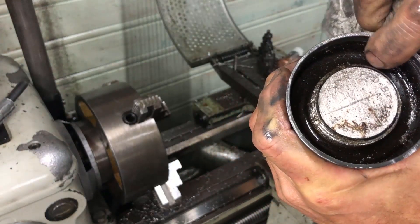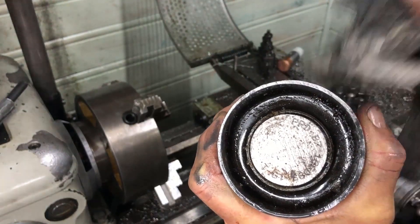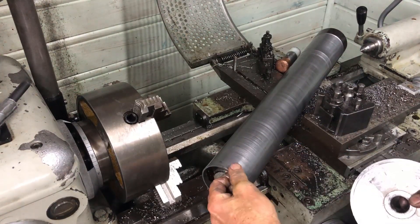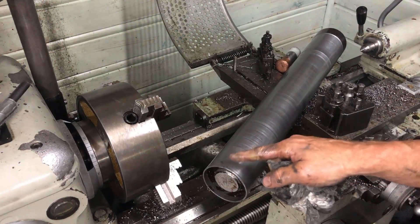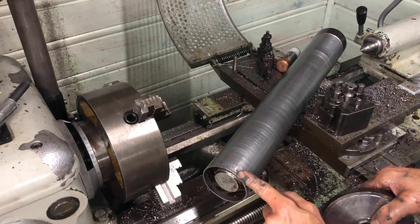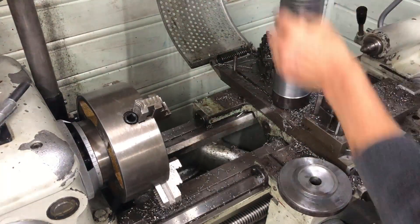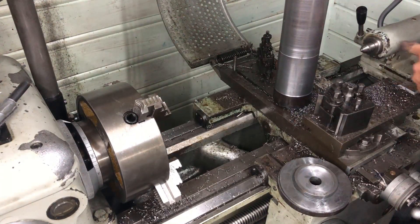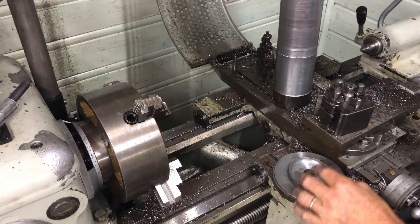There you can see the inside, where there is a cast bolt in the middle with epoxy granite inside the tube. I did not have any 80 millimeter bolt, so I had to revert to some alternative ways. This was rather alternative because I really would have wanted to use the steady, but it only has 75 millimeter capacity, so this was a no go. In the end it turned out okay, and the foot there also left a little bit because of lathe incapacity — but it will go down in the square column anyway, so it doesn't matter.